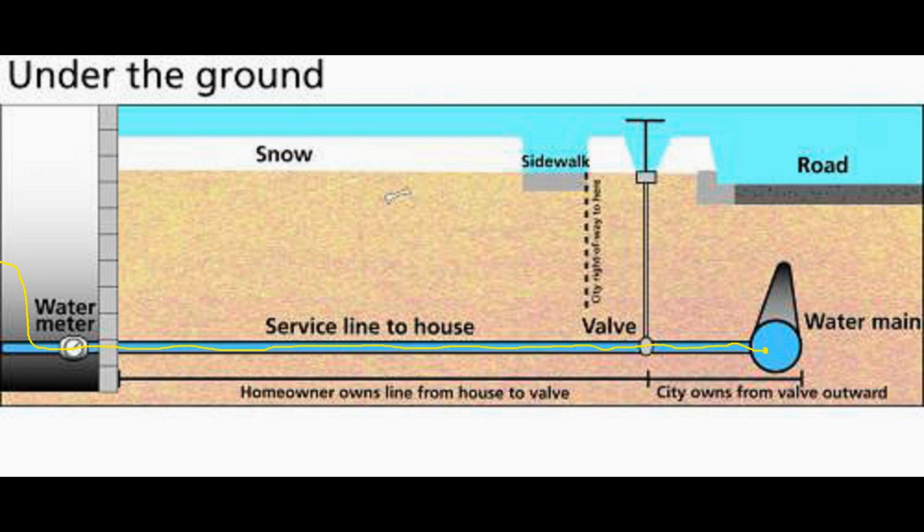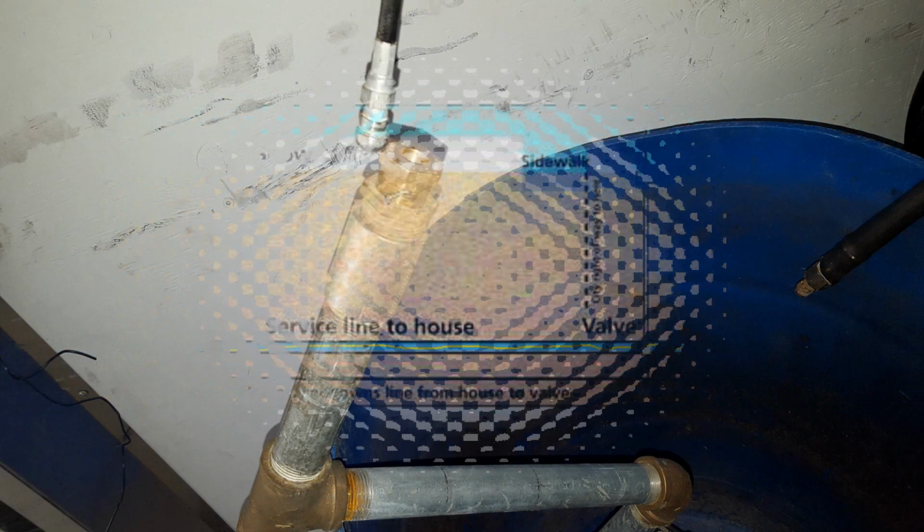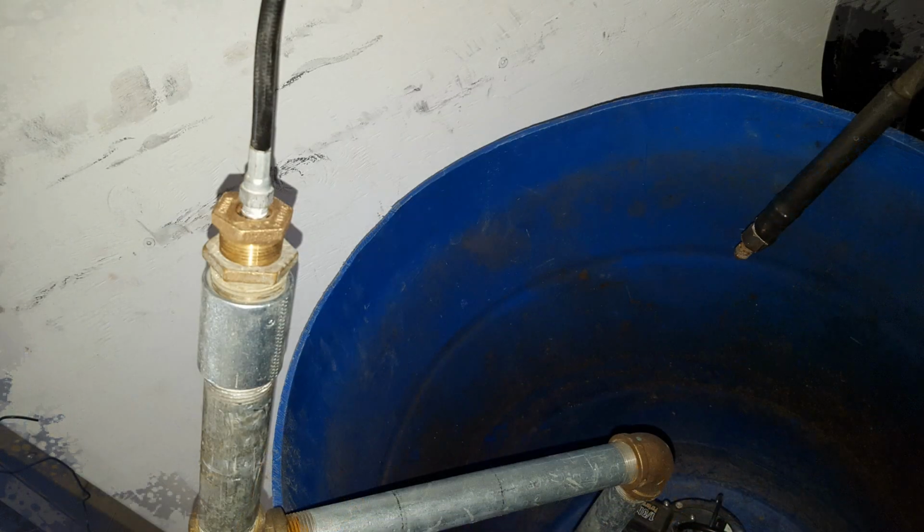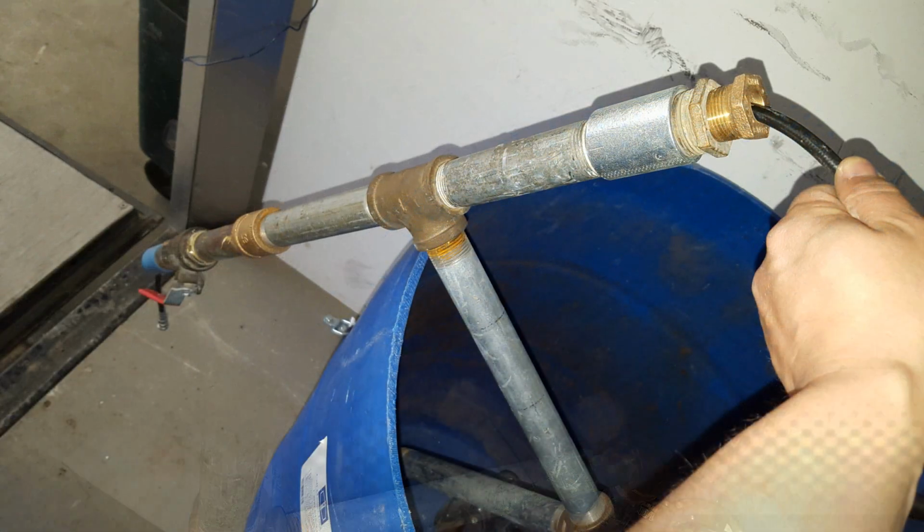Now you're going to want to take the 1/8 inch high pressure hose with a clean jetting head on it, and feed it into the line until you reach resistance, usually somewhere around 50 feet, or you might hit the ice blockage first. Whichever comes first, at this point you'll want to turn the flow on to the high pressure hose and start shoving your line through. You're going to be feeding water through that hose and it will come back at you through the bypass, but your sump pump should keep up with all of the flow once you do have a water line turned on.